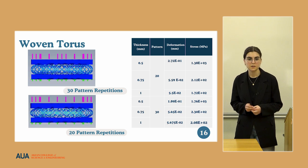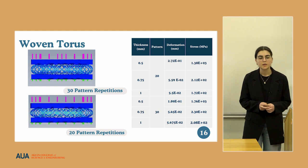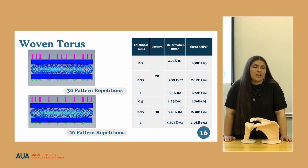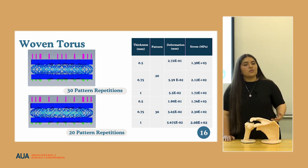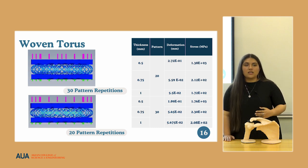And it comes back to its original shape, regardless of how much force we apply, it depends. It does have plastic deformation that doesn't come back if we exert too much. There is a certain point after which it won't come back. Of course, there are a lot of stimuli that can help bring it back, but without a stimulus, we need it to deform up to 8%. It's arguable. There are some studies that say it's 8%, some studies say that nitinol can go up to 10%, which is quite a lot compared to other materials. After experiencing that amount of deformation, it's able to revert back to its original shape. Past that point, it doesn't.